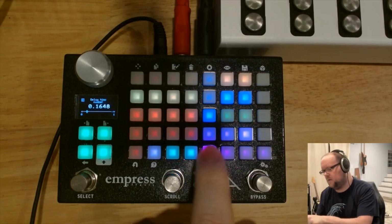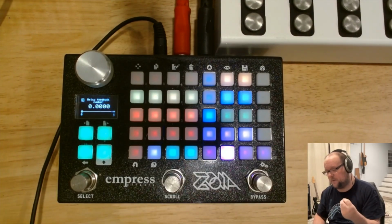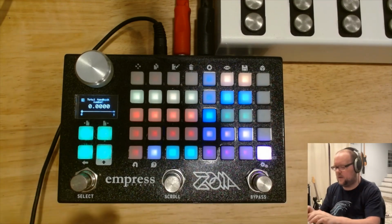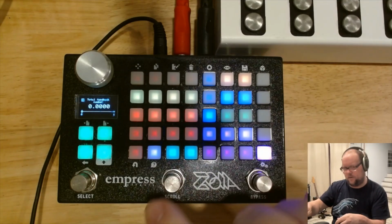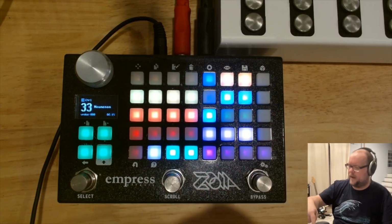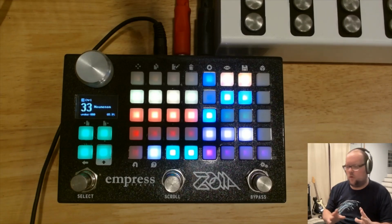And then finally we have a delay with mod set to a tape style. We have delay time, feedback, and this is another feedback path, right? We've got feedback in this buffer, but then we have feedback in this delay and a mix. And then finally, the output of the entire circuit can be fed back into the oscillators, which creates some really chaotic sounds. So everything coming out of the patch gets fed back into the FM inputs of these oscillators. So that's the control breakdown.